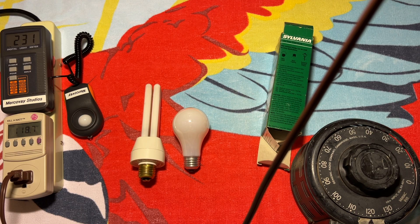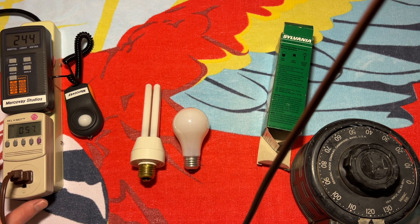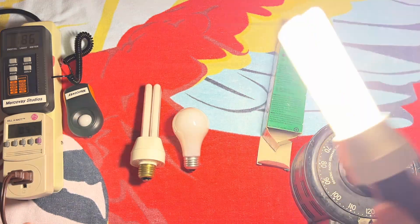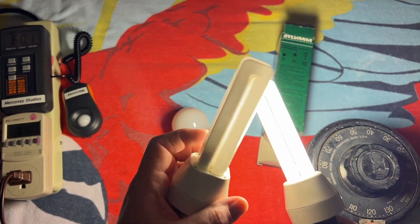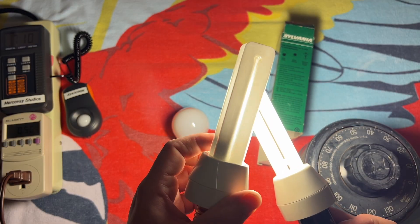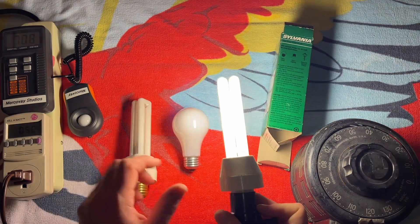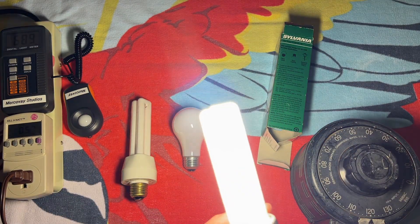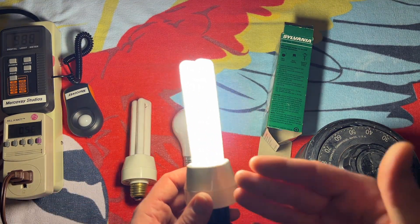With our brand new bulb held at the exact same spot, we're getting 235 lux, 0.26 amps, 17.8 watts, and a power factor of 0.57. So definitely no phosphor degradation on the brand new one, but there's certainly some phosphor degradation on the used one — you can kind of see it. The tubes are a little darker in some spots than others, obviously down by the electrodes. But that's just going to happen with age — the phosphors are going to degrade and it's just not going to put out as many lumens as originally when it was brand new.